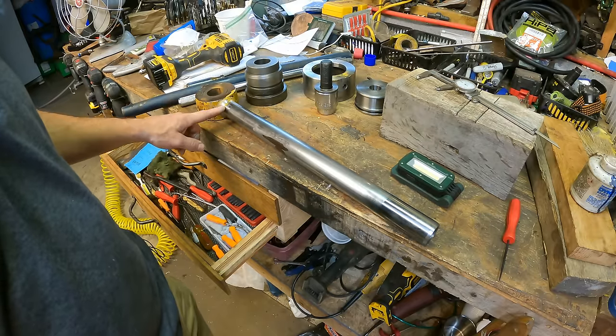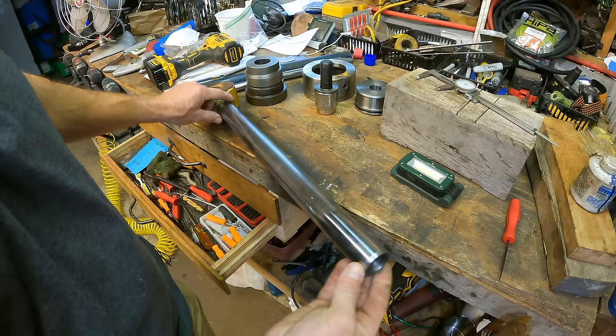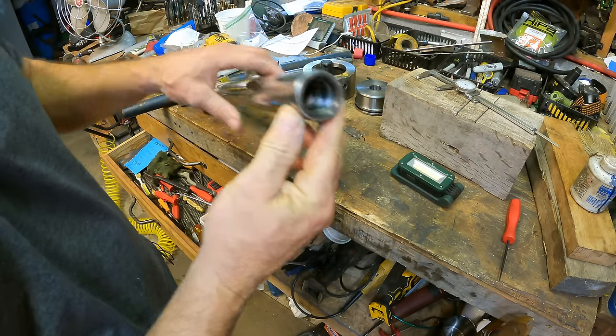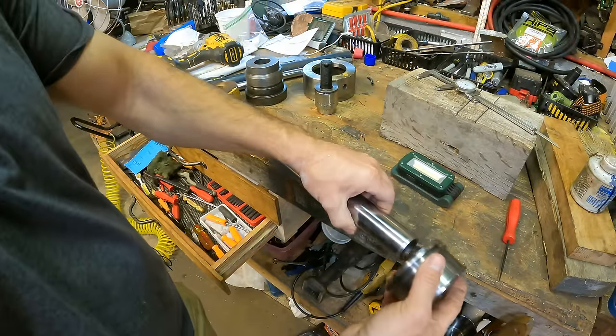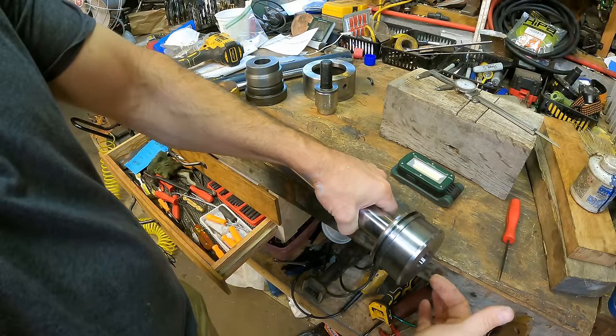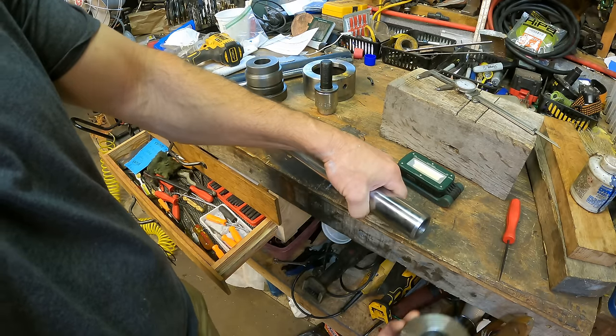And then cutting this weld, it would be nice to have button inserts, and I don't have any. That's one thing. But the big thing is this: I was not expecting this to be a bolt. Typically, this is an external thread here. The piston would go onto a shoulder, with the thread sticking out, and you'd have a nut that you tighten down. I've never seen one like this.